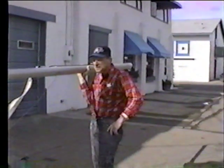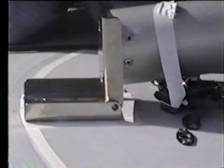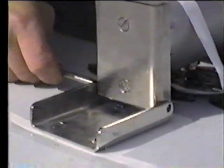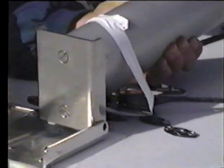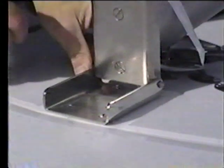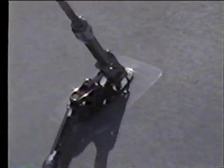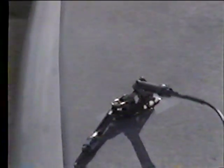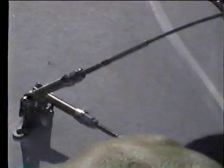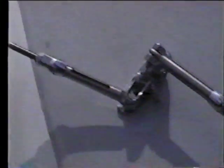Now is when you want to pick up the mast, so this is when you need a friend. You have to have a friend hold the back, and somebody else at the front. Put the butt of the mast right down onto that plate — you can see they match up perfectly — and Tim's going to put the pin right on through there. Sometimes it's not going to line up perfectly, so coordinate with the guy holding the mast and the one putting the pin through to rock the mast or walk side to side. Put it through the back hole and put your little pin on. A really good idea next: make sure your side stays all lay to the inside. Push them over so they're able to stand straight up, or even lean them in a little — if they're leaning out when you go to put them up, they could get snagged outwards.